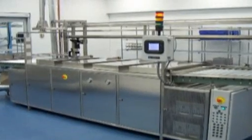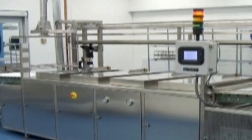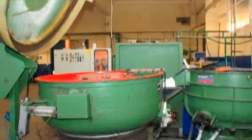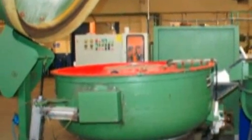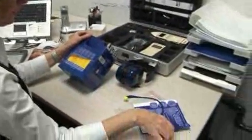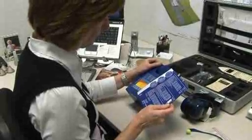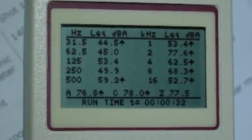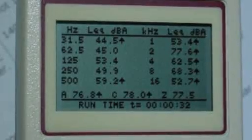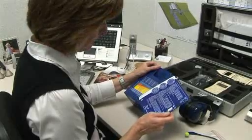Some machinery can emit high noise levels at very high frequencies, for example, an ultrasonic cleaner, or very low frequencies, for example, a rumbler. In the case of hearing protection, the assumed protection values, or attenuation stated by the manufacturers, vary at different frequencies. The ability to measure the sound levels at different frequencies is therefore essential when selecting hearing protection.